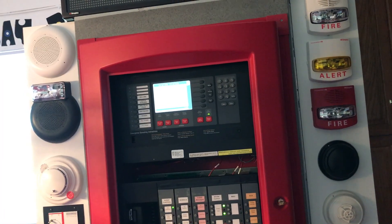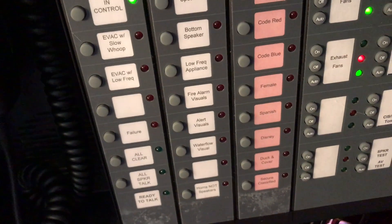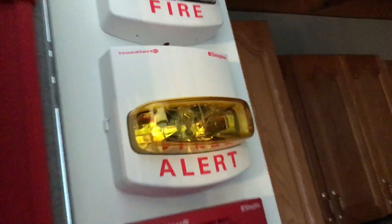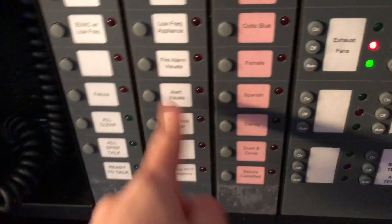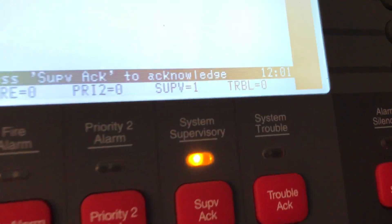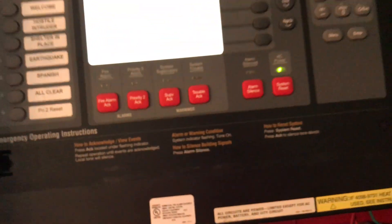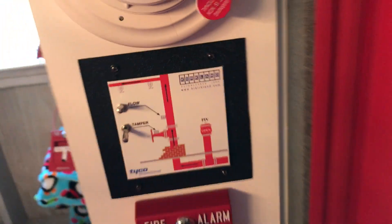You can also turn on just the visuals manually — the fire alarm visuals will flash. We can also do alert visuals, which activates just the alert strobes. Next, hitting the tamper gives a supervisory condition as you can see — it's self-restoring, so it clears without resetting, meaning it's non-latching. We can also pull up flow — flow will only set off the red strobe, which is for water flow. It's automatically silent and the panel reads 'Fire Alarm.' Then we go ahead and reset.